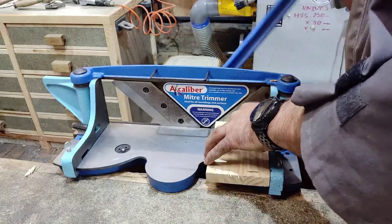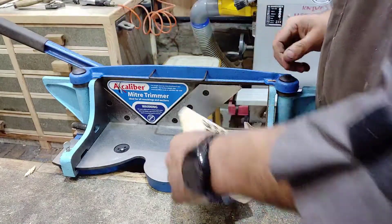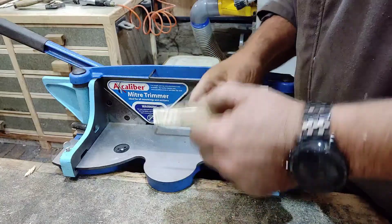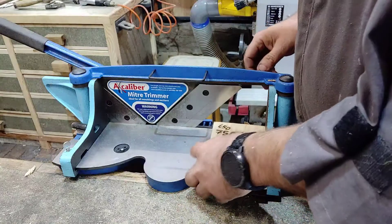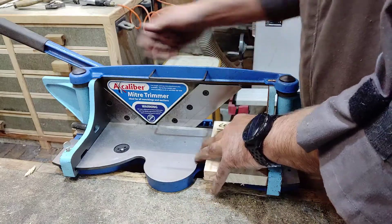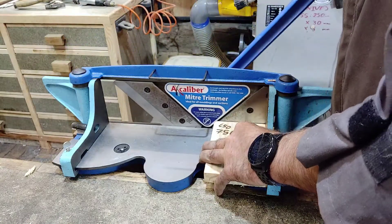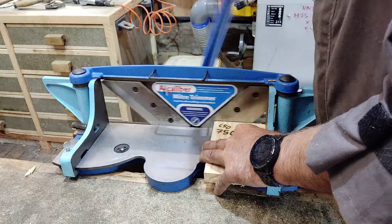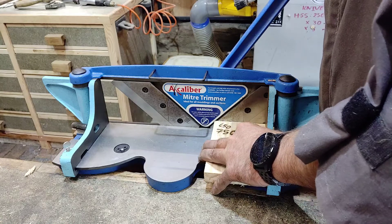You can make your cut all the way along that 90-degree piece of pine. So I've made one cut in one direction, as you can see there — that's pretty smooth, pretty damn smooth. All you do is you flip it around to do your next 90 degree. You bring your cut across and you can have a visual check: is that touching, or are there any gaps? So you can put it across there — there's no gaps — and you're pretty certain that it's at 90 degrees.